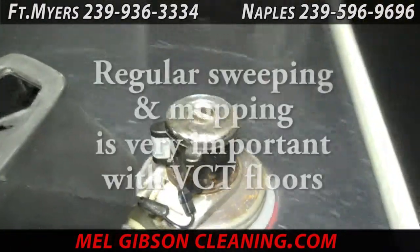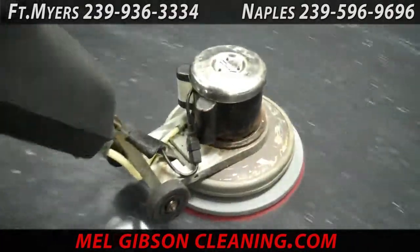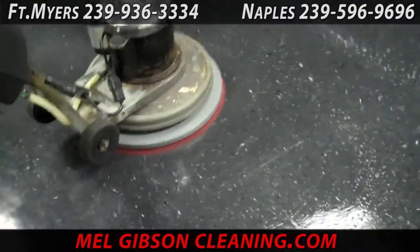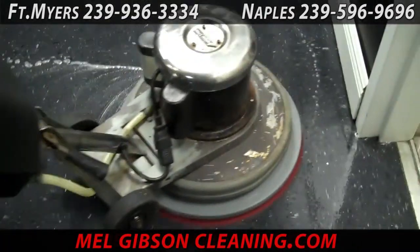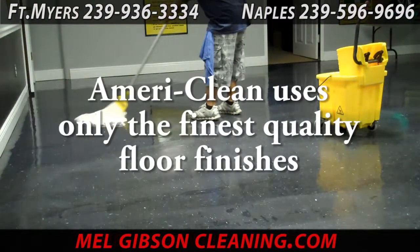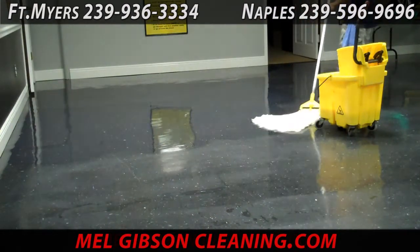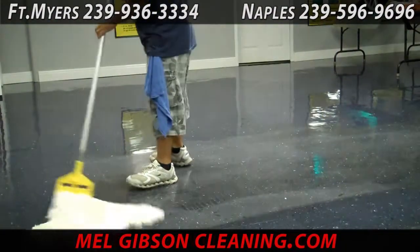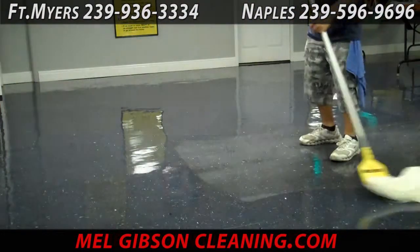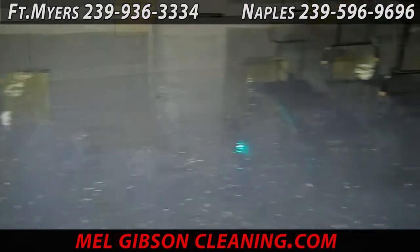Vinyl flooring is designed to have floor finish on it. It simply will not stay clean, will not stay shiny, and will not perform as it is designed without floor finish. So the idea here is we're scrubbing the floor with a solution that will loosen the dirt out of the finish but not remove the finish. Some of the traffic areas require extra attention; we have brushes for getting up to the edges and corners. Once all the dirt has been scrubbed loose, we wet vac and triple clear rinse the floor, then apply the floor finish. Floor finish is actually there to provide a barrier between foot traffic and the vinyl itself.